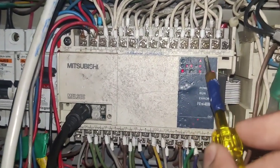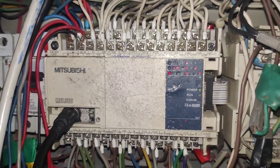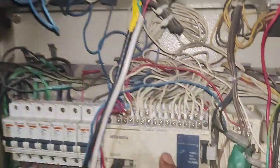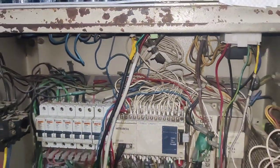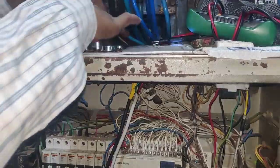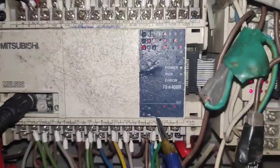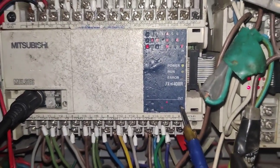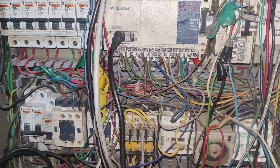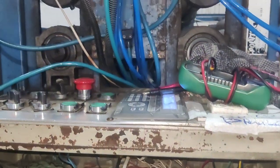First, see Mitsubishi PLC some basic concepts. In this PLC, we have total 7 digital inputs. When light is blinking, that means input is coming. For example, when emergency push button is pressed, so 2 number digital input will show. When emergency is released, 2 number digital input is not showing. Now in output, when 7 number output is coming, contactor should start — it's for only basic information. When 7 number is blinking, contactor is started and machine is running.